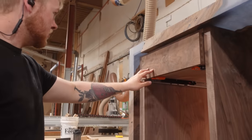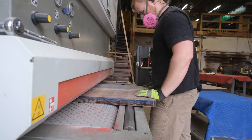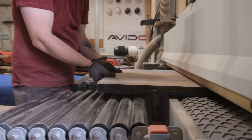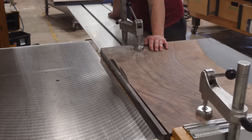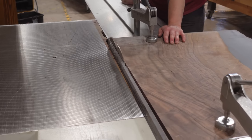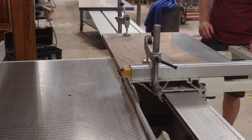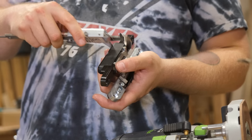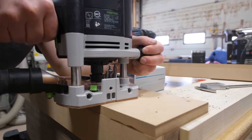John lifts the drawer boxes in. The piece also has Bastogne walnut and resin on the front side of the desk, where there are two giant doors and a drawer. We're thicknessing those on our sander, cutting them to size on our panel saw, and from there installing the hardware. On all of our cabinets we like to use Tectus hinges — again not sponsored, but we would like to be — primarily because of their high capacity, allowing us to hang these big heavy doors without worrying about overloading them.